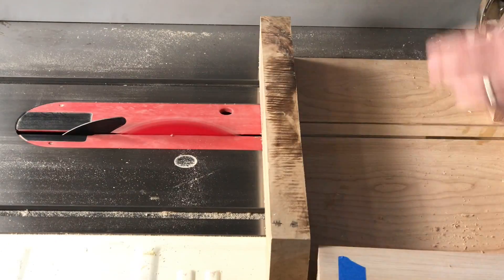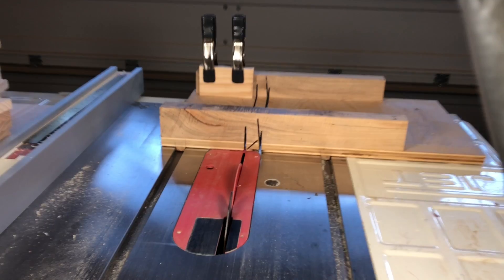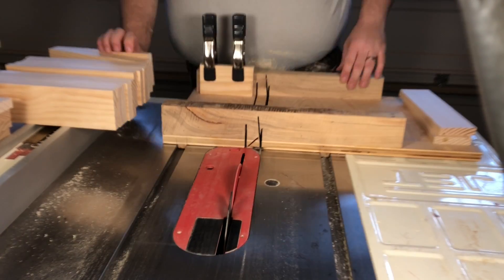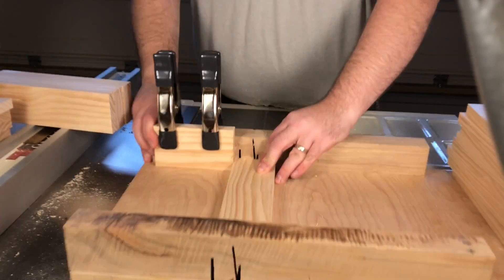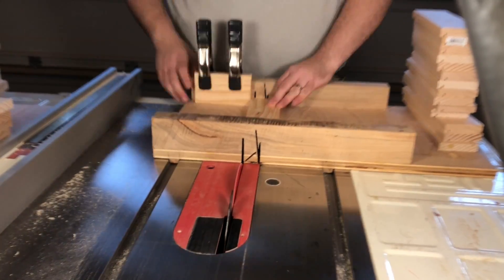I intended all along to cut a thin groove in these pieces so that I could have a consistent place to hang the bucket that I was going to use for the test, but I forgot to do that until after I did the taping glue up. So here you see me going in and cutting that slot in all the different pieces so I can have consistent results, using a stop block so it's an equal space from the edge of the board.